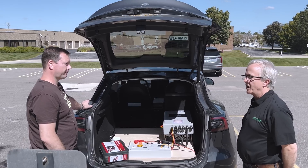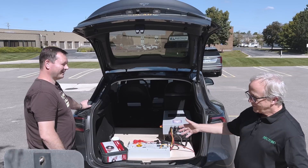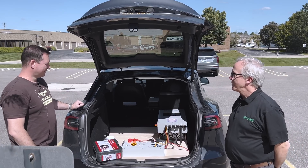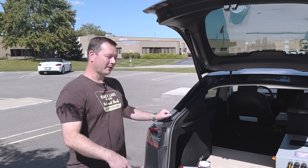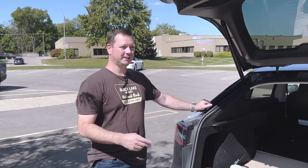Do you expect any idle time at the campsite, or will you be spending all your time manipulating solar panels and getting people to stop parking in front of them? That's one variable I'm not sure on yet. I thought about setting up a little perimeter — putting it out a bit further than the panels — so if anyone stands up to that perimeter, they won't be shading them. That can really hurt my solar harvest. I'll have four strings in parallel and then 16 in series.